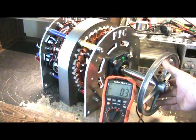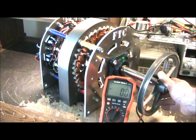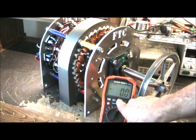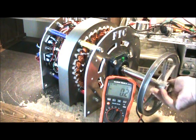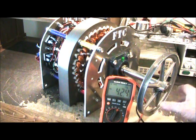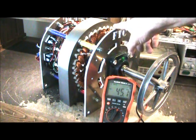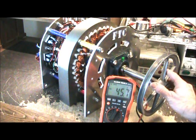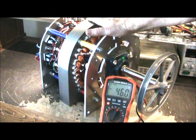Again, it's easy to turn — see that? Nothing to it. It's got more powerful magnets, but it turns more easily. The reason it turns more easily is because of the way I've got the magnets set up. I've got something now that can turn — look at that — 42 volts, there's 45. We could never get this kind of voltage, this kind of power out of a single generator. This generator is producing higher voltage with the same coils that we used to produce 20 volts.